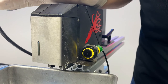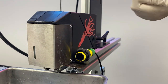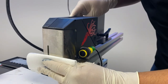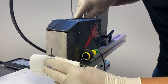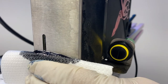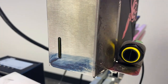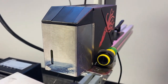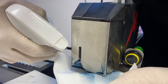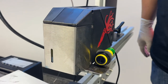Once you think you've got all the egg residue off with your cleaner, go straight to the purge button and prime the ink out of there. That will help push out anything resting on top of the print engine. Remove the tray, get a lint-free wipe folded, and prime the print engine. Once satisfied, clean that down, and if there's a little bit of ink left, take the ink cleaner and spray that off.